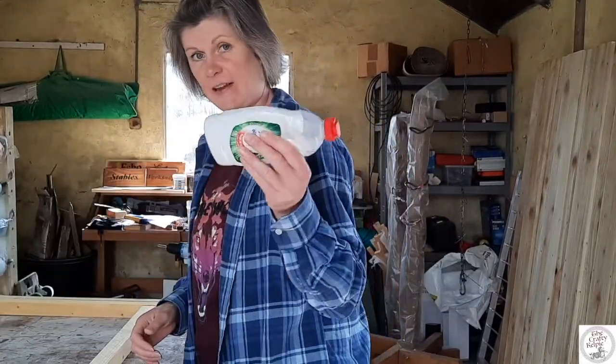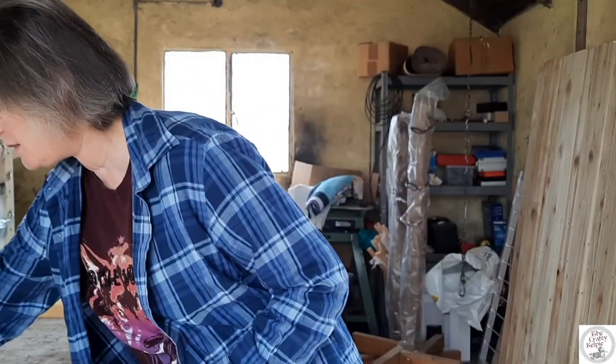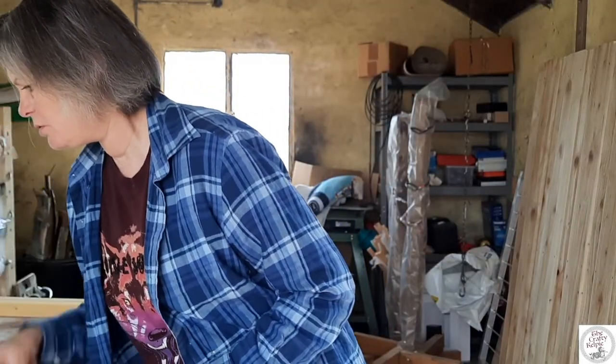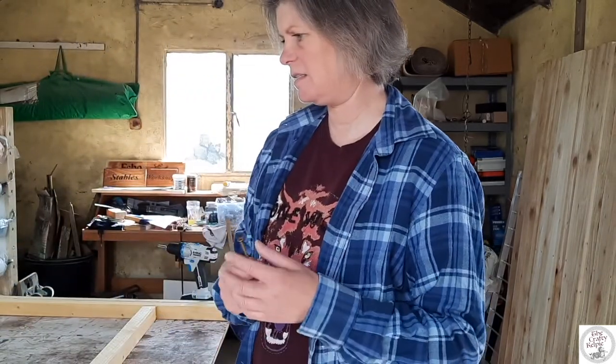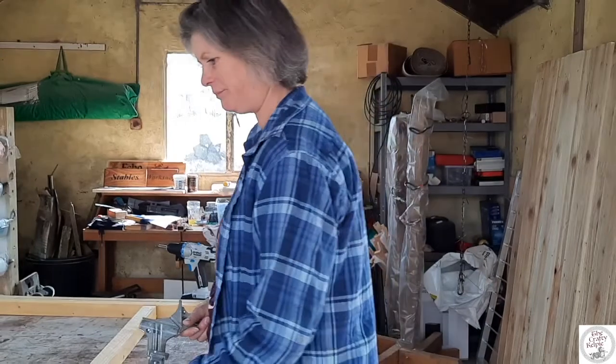PVA external wood glue, Screwfix is fine. I'm not sponsored by them. Definitely a pilot hole as well. I'm going to use 5x70s. Corner clamps, it must be serious.